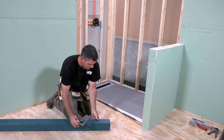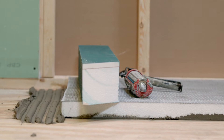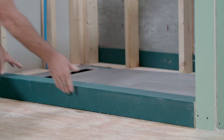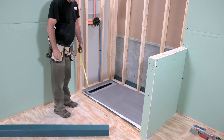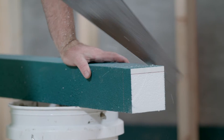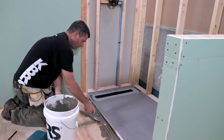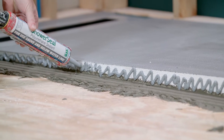Installing the KBRS hard curb is a simple process. The KBRS hard curb has a self-sealing polymer anchoring cap that seals around screws used to anchor shower enclosure hardware. When installing the hard curb, be sure that the anchoring cap remains face up. It is also important to note that upon completion of your tile shower installation, holes are not pre-drilled into the anchoring cap, as this will eliminate the watertight seal around the screw. You can either measure your distance from wall to wall or mark the curb by placing it in its final position and making a mark. Cut the hard curb using either a handsaw or miter saw. Spread modified thinset using a trowel in the area where you will be installing the KBRS hard curb. Next, apply a generous bead of shower seal polyurethane sealant to the vertical edge of the shower slope to which the curb will abut.